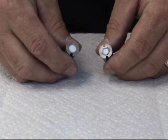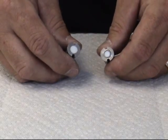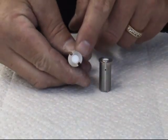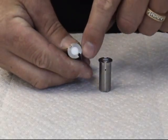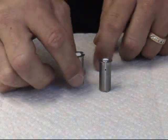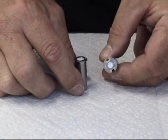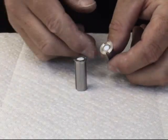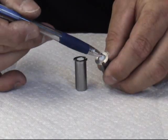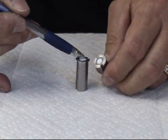One of the questions you may be asked when you call to order plungers is whether you have a self-compensating or a pin plunger in the nitrous side. As you can see here, this is what we call a pin plunger — larger diameter, the white Teflon plug, and it's very flat across the face. This is what we call a self-compensating plunger. You can notice the Teflon plug is a smaller diameter and it has a raised ring in the center, and the plunger is actually floating in there versus the pin plunger which is solid and pinned.